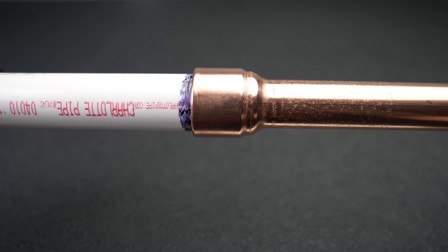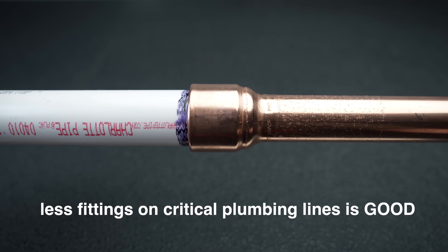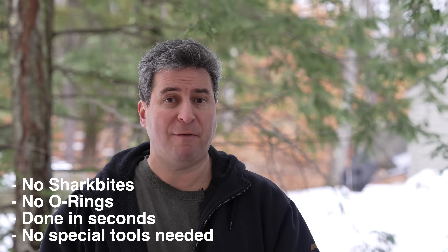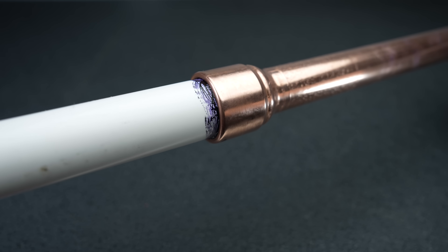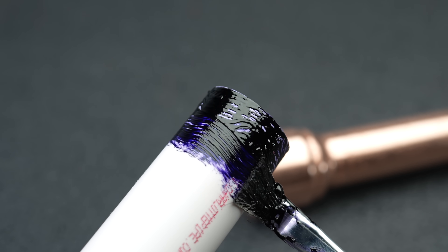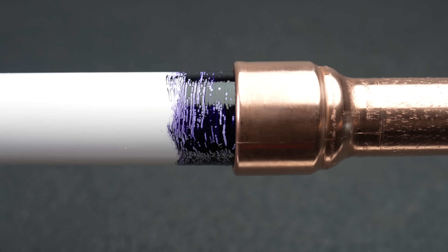Personally, I am super impressed by this because many times if you've got a well, you're going to be coming in via CPVC or PVC and that connection is critical. I don't want to use a SharkBite in that type of situation where I could be having movement in the pipe — I simply want to make sure the connection is as solid as possible, and nothing is going to beat a glued connection. Seeing someone insert PVC into copper is just nuts, and the fact that it's made by a real company gives me confidence that this adapter is going to stand the test of time. These fittings are not super cheap.